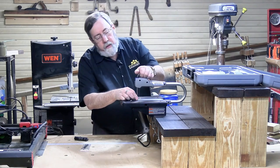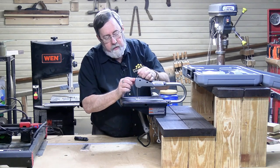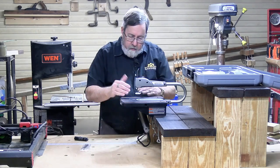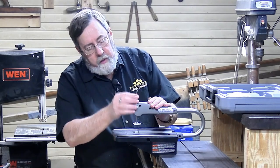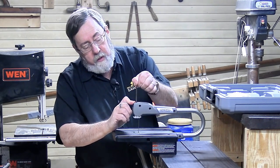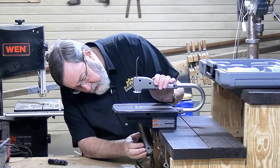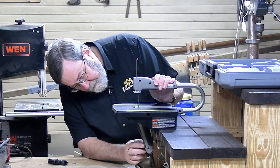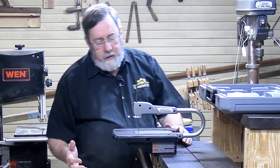The pressure foot here is a little different than what I've seen on other saws — there's no knob to tighten. There's a button that relieves the pressure, and you've got to get the pressure foot in contact with the wood. The controls consist of the tensioner adjustment — you can push it down without the button, you only need the button to bring it up — the blade tensioner, and on the bottom a power switch and speed control. It's not very big and there's not a lot to mess with, but then again it's a scroll saw — not a really complex tool.